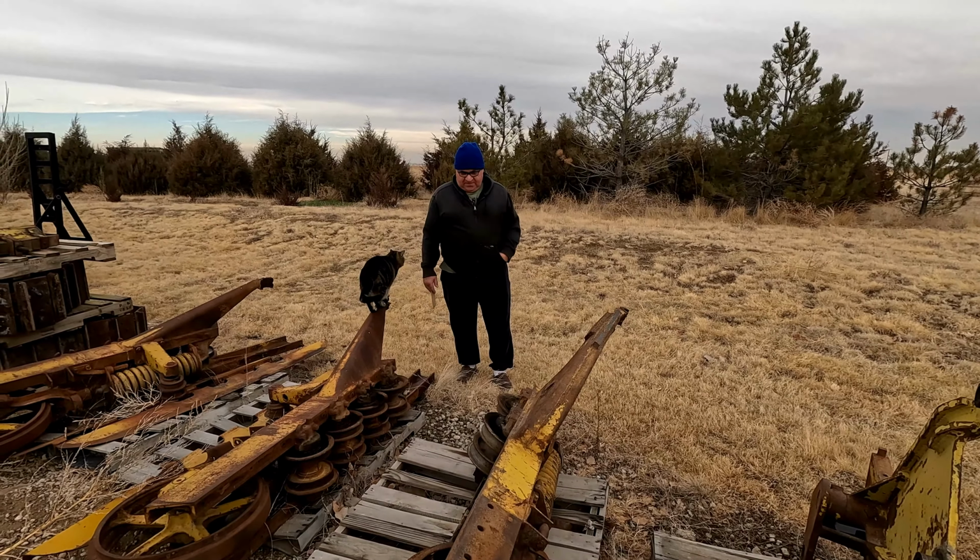Comparing the idlers on 4Gs rollers here, or track frames, and 7Js, and it looks like 7Js are in better shape than the ones on 4G. Dad's giving it a little bit of a measurement here. Just a rough idea. And what are you coming up with? That's a little over 5/8 of an inch. These are a little under 5/8. Yeah. A little bit of difference.